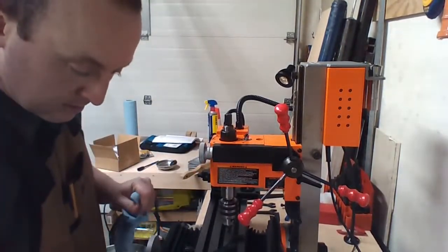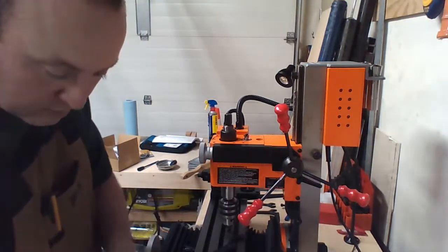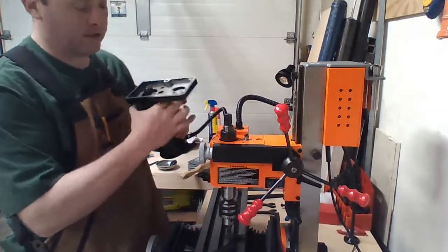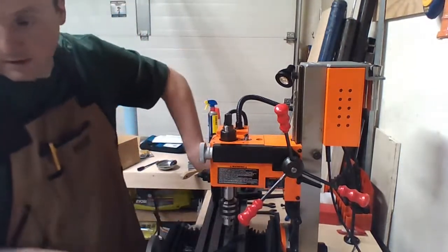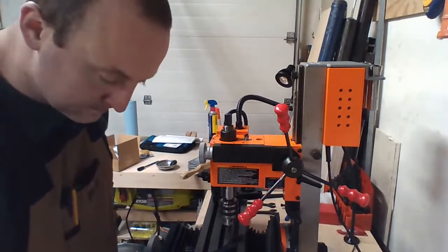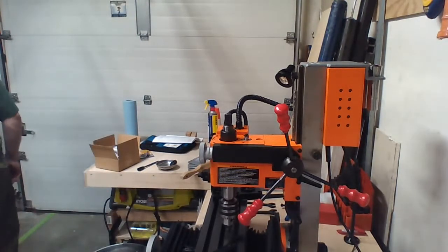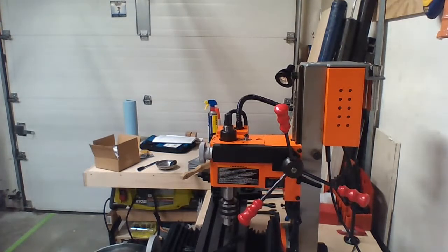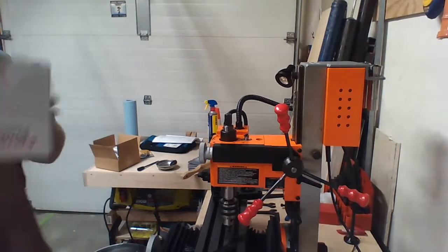So, remove the 4 6mm socket head screws on flat cast iron between the motor mill and the motor head. So flip this guy over. These 4 screws here. If I can know where to place it. Okay. Let's see here. Something to raise it up without damaging it. Would use wood, but not here. This one. Protein box.